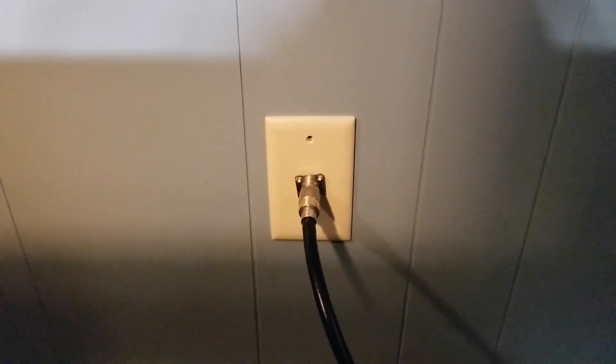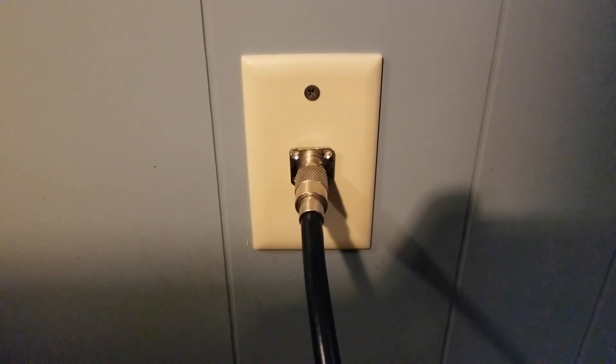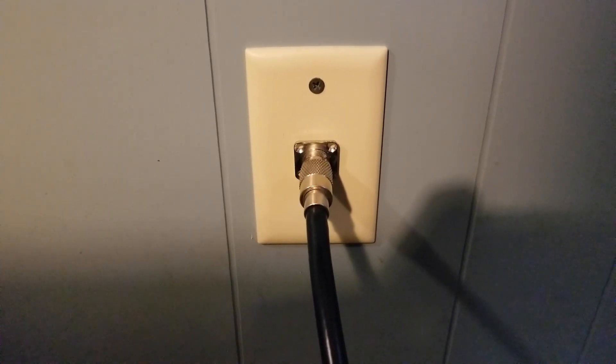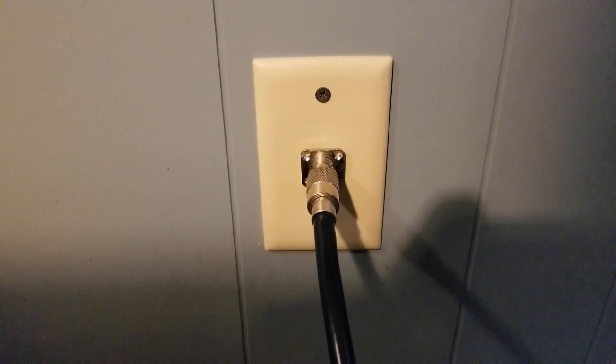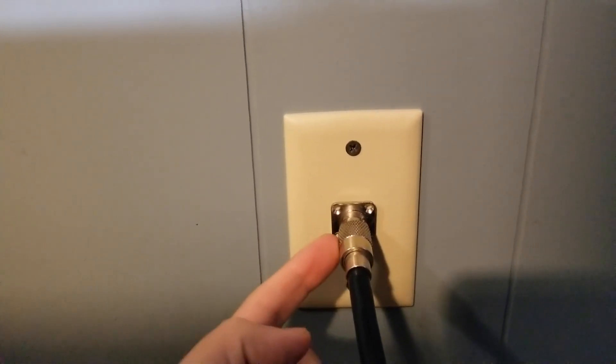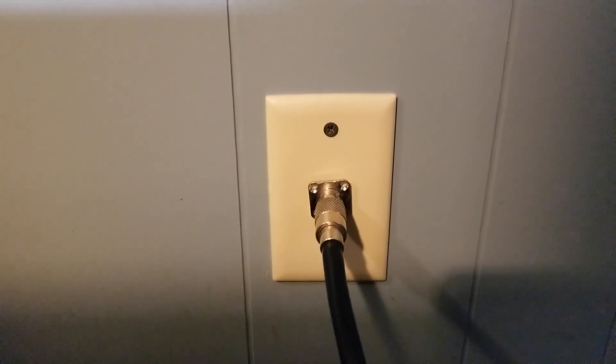Extreme close-up time — this is the other side of that wall. You have to look at your wall and see where your outlets are, and gamble a bit to make sure there's nothing behind where you want to drill. So what I did was come in from the outside with that coax through the hole I drilled through the wall, and then I put a hole in a blank face plate cover and put a couple of coax ends connected to a barrel connector — a chassis mount barrel connector — so it looks all nice and pretty. That's how I get my coax into the house.